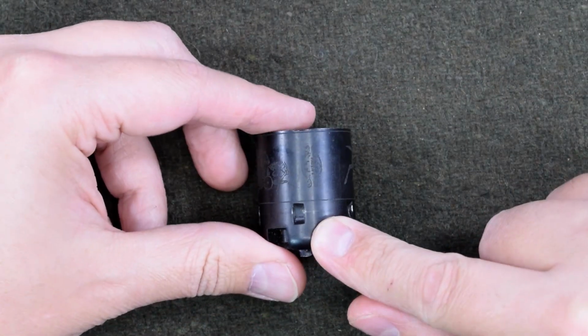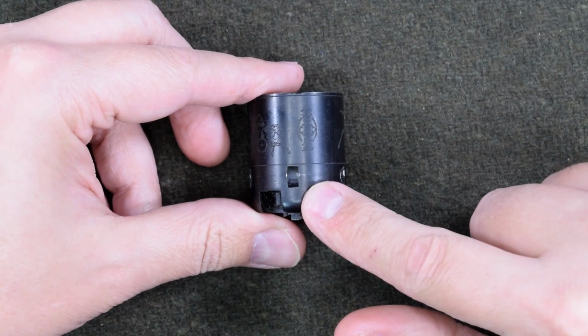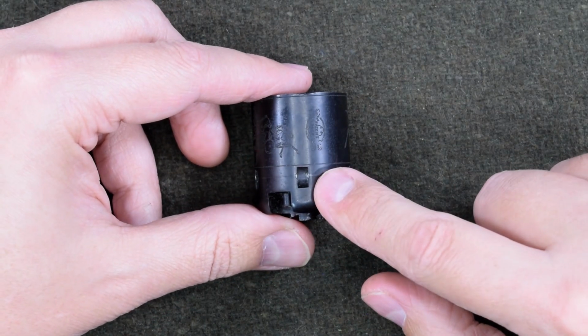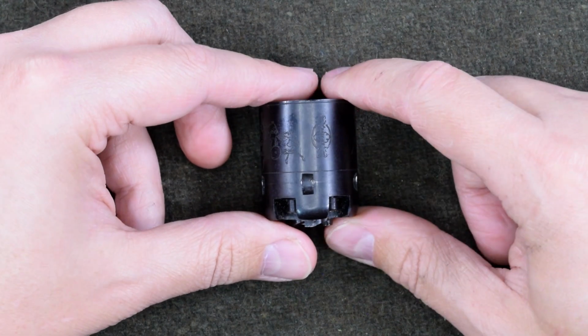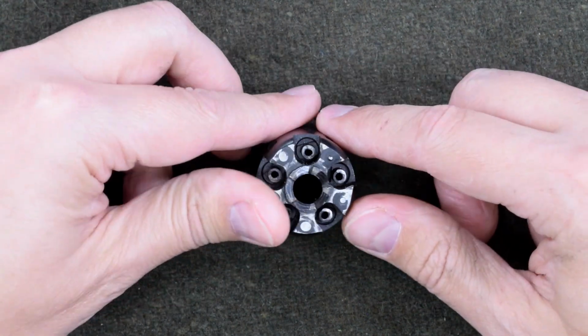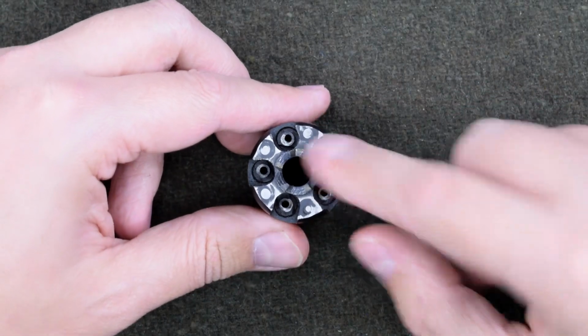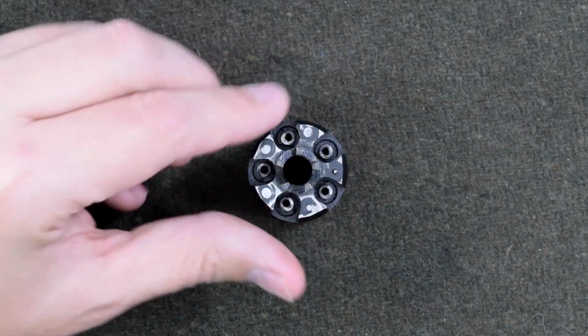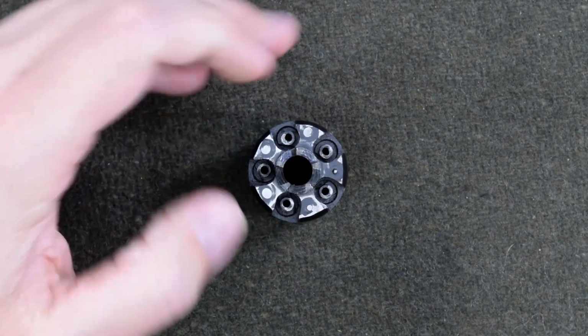The cylinder stops are incorrect because these are rectangular, which technically didn't exist at all in this gun ever. They were round originally, changing to oval and then eventually rectangular with a scallop. We'll see that again in a moment. Otherwise, if we look at the back, this one's been modified because it used to have 5 safety pin positions, but 4 of them have been filed off in an attempt to make it more accurate.